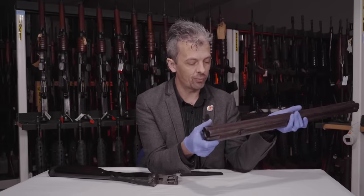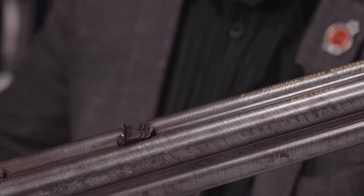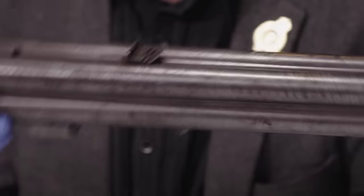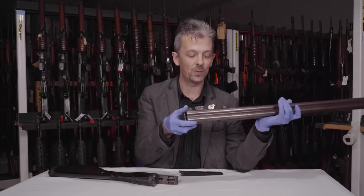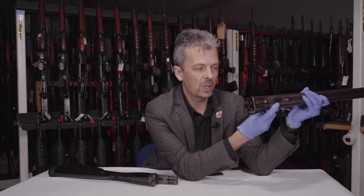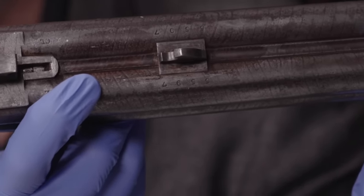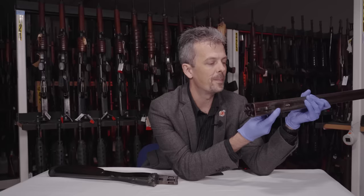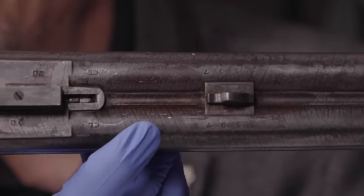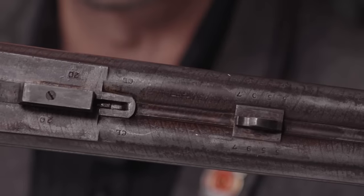The barrels are Damascus - in the firearm sense, not the true Damascus edge-weapon sense - so a spiral twist forge-welded together. Over time that wears, so these were browned. This Damascus finish is more than just twist; twist would be literally just coiled together, but this is spiralled, welded, and twisted - it's an astonishingly nice bit of metalwork you'll find on high-end sporting guns. If we flip it over you can see what it looked like when it was newer. You could re-etch and re-brown it and it would look amazing, but we're a museum - we preserve and conserve rather than restore. You can see the browning and the beautiful Damascus pattern on this patch that's been protected by the fore-end.